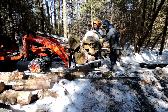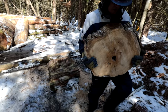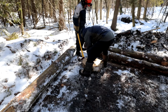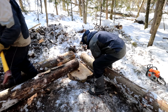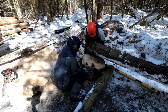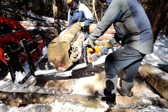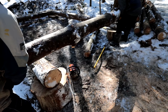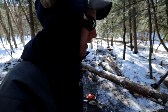After careful consideration, I determined it was probably a bad idea to have pine logs sitting directly on the soil, so we ended up picking up some offcuts of cedar trees from the upper level and made piers on all four corners to get it up out of the dirt. Cedar tends to be more resilient to moisture and should last forever. Bonus: if you ever need to level it, once the ground thaws and maybe sinks a little in one corner, you can actually just move that corner up or down. We're also putting another pier in the middle where our door is going to be — you can see the sugar shack is shaping up.